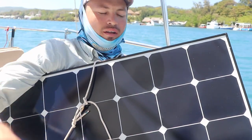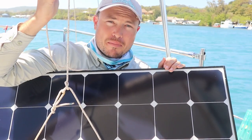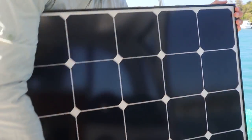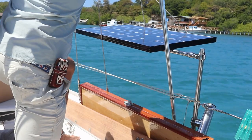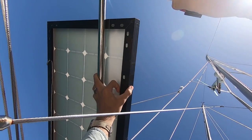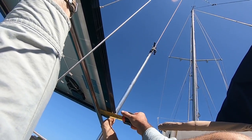The stainless steel tubing is in place, secured, and I like it — turned out just the way I was hoping. We got the solar panel and I'm going to dry fit it and make measurements for where on the frame the brackets are going to go. Got the measurements, so let's go make those brackets.